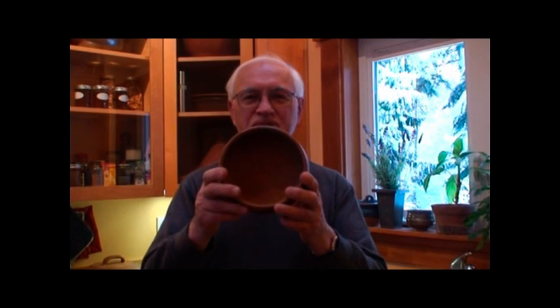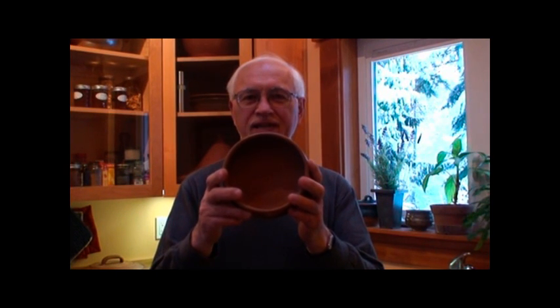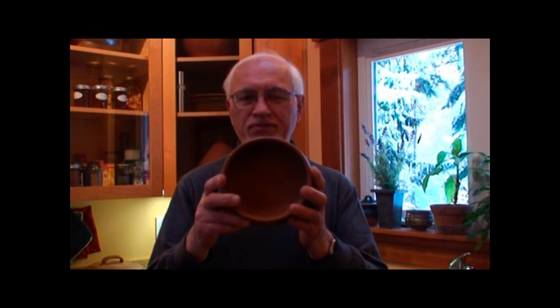Welcome to Meristone Pottery. We're going to take this particular bowl, which has already gone through 20 cycles of thermal shock testing, and we're going to heat it up dry on our burner until it reaches a temperature in excess of 600 degrees Fahrenheit.